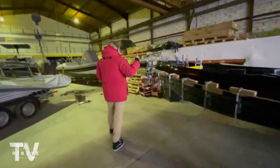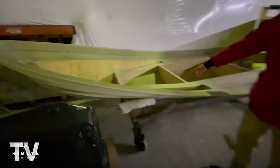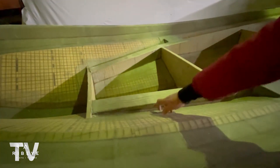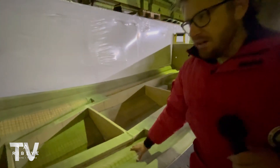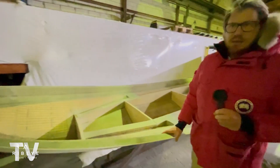This here is worth quickly looking at — you can see the longitudinal and bulkhead structure, and see how they're infused in. There is no secondary bonding, so it's super strong and really light because we've used this high-tech core. That's how all of our Prime Series boats are built.